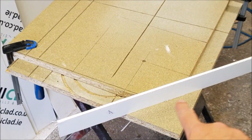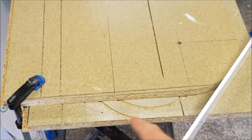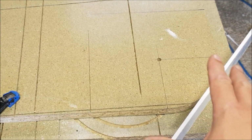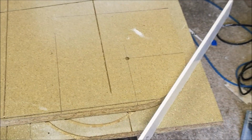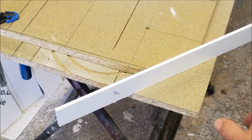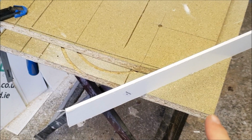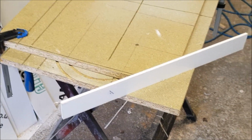Right, so the plan is to apply heat to the centre part of the perspex, and then to bend it round this former. And it's important to have a board at the bottom so we can press it down and keep it flat in that plane, so that if we just had the bend, we could bend it at weird crazy angles without realising. So it's important to have that flat bed. I've no idea how this is going to go. I think what I'll have to do is remove the plastic protective film from the perspex first, because that might melt onto it. Yeah, let's have a go.